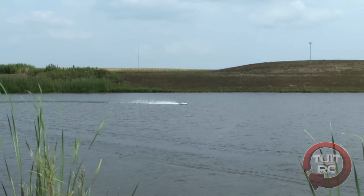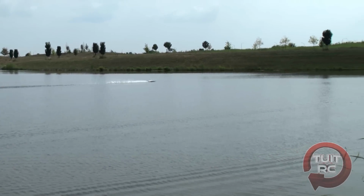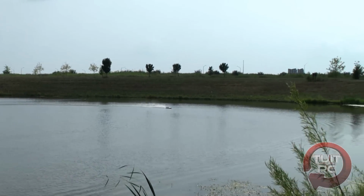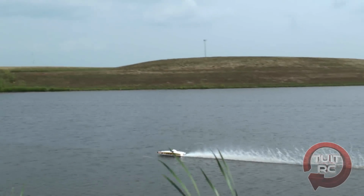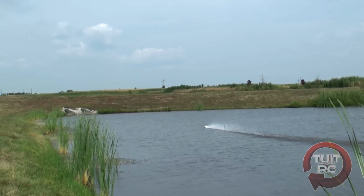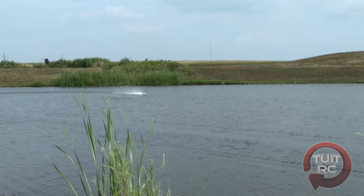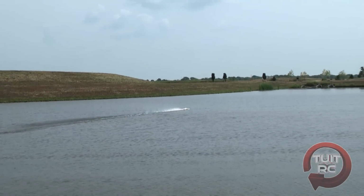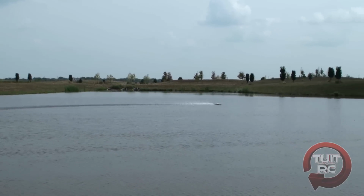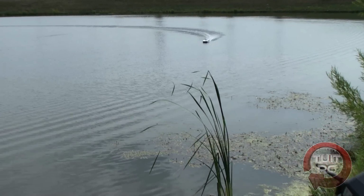Wow. Now, can you jerk it full speed? Can you jerk it hard to the right or left, and will it flip, or is it pretty stable? It could, just if it catches a chine or anything. It's really designed for heat racing, which would be mostly turning right, but in the offshore course, we actually make a left correction. So that would be a typical race course. This boat will turn both directions, but prop torque tells us we like to turn right.